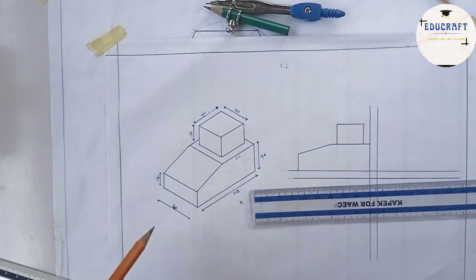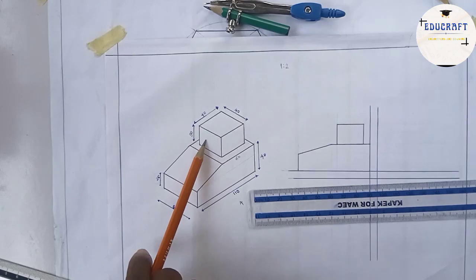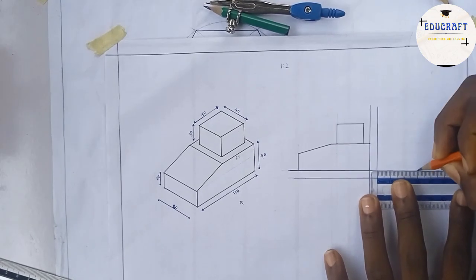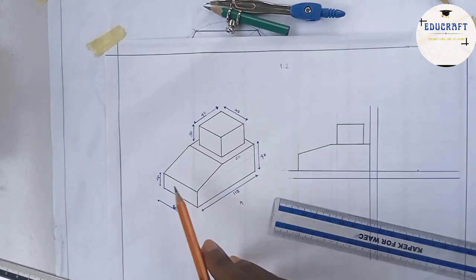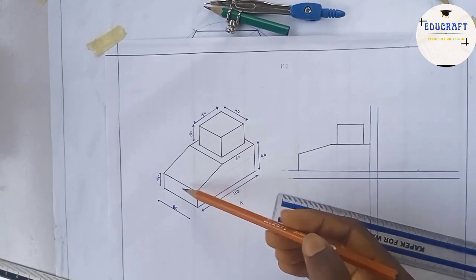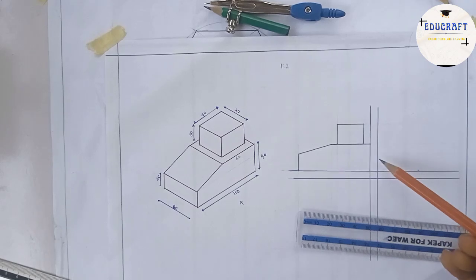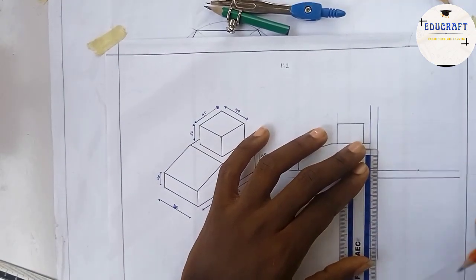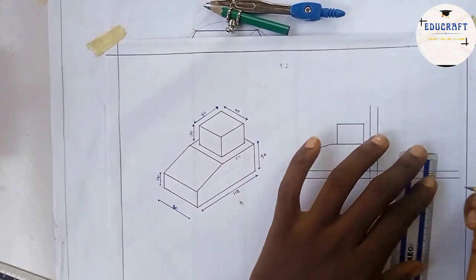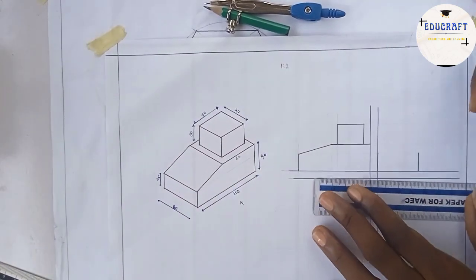If this is the front view, the side view is over here. On the side view, I'll see this part and this slanted part as well. This dimension is 60, so scaled it becomes 30 — I'll mark that point at 30. Then going up 25 scaled gives 12.5. Since this 12.5 is the same length already shown, I'll just thicken it and join it.